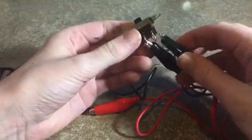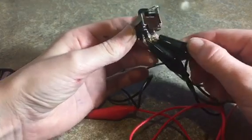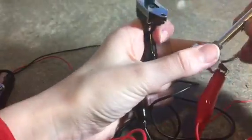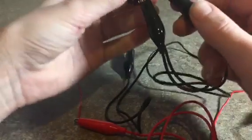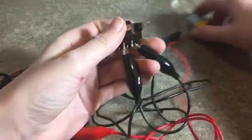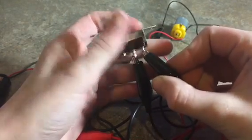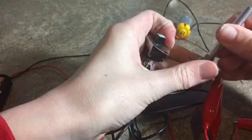So what you want to do now is — usually I would just tap these and wait for the motor to go. But the thing is, we have a potentiometer. So do the same — just tap those. Turn your potentiometer all the way up, just make sure it's up. Then you'll find the one that does it. So then you just want to clip onto that one. Now you have that attached to a switch — you can turn it on, then you can do your adjustments, or you can turn it off and your adjustments don't work.